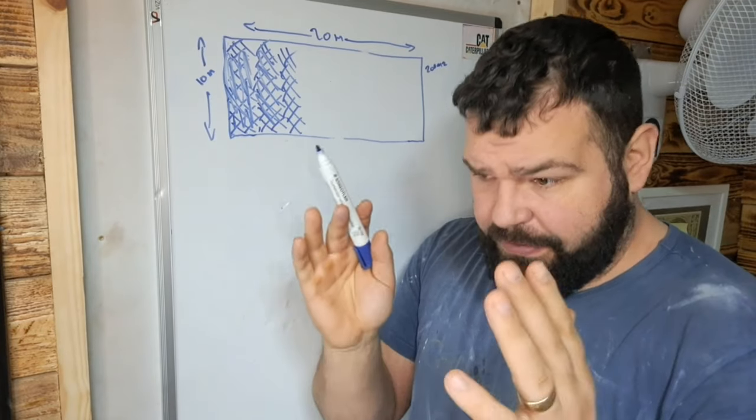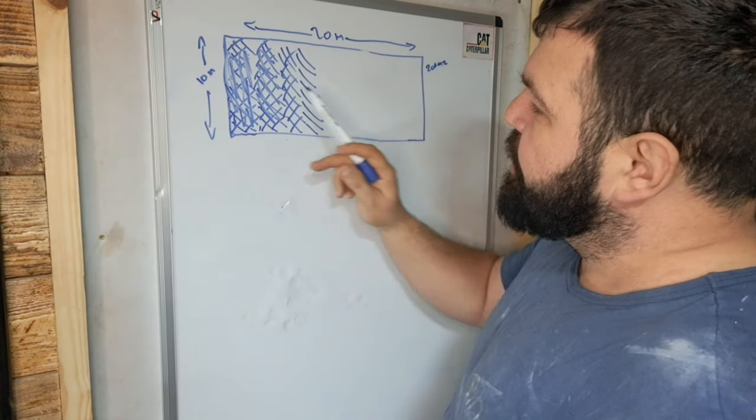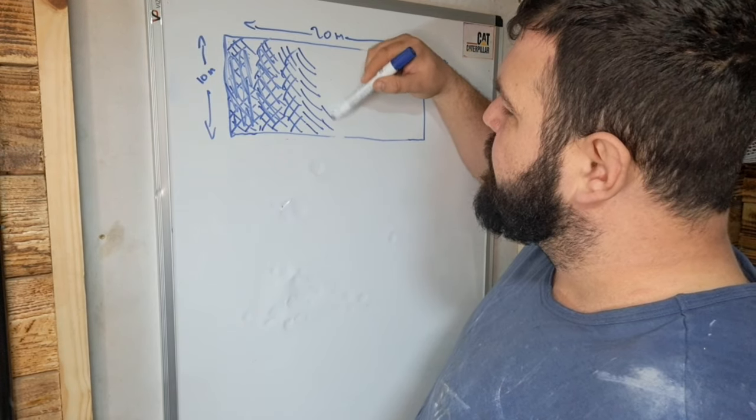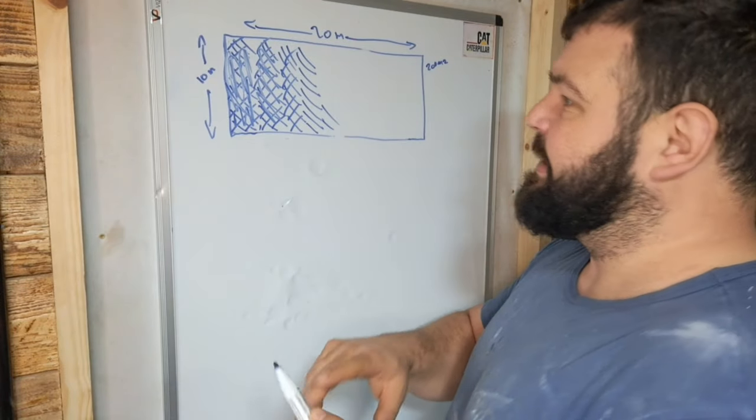Limitations: when you come in for your first coat of the next stage, do not use more than one bag of plaster. You can only go forward as long as one bag will allow - if you put three bags on first coat you're leaving the previous section too long and it'll all go wrong. Only one bag at a time. Also make sure you always use clean fresh water - you can't use dirty water for this, it'll go wrong. If you want me to come and spend a day with you for tuition, hit the link in the description. If you found this video helpful and want to buy me a pint, there's a link for that too. Cheers guys.